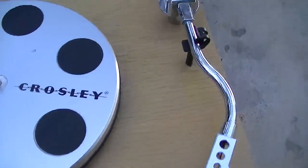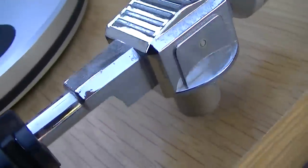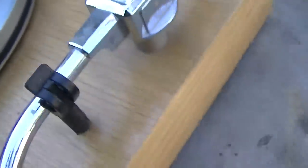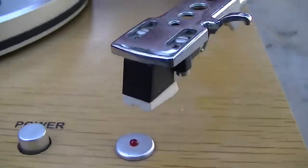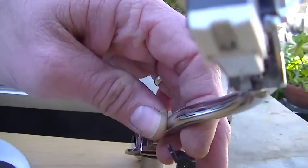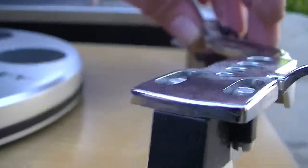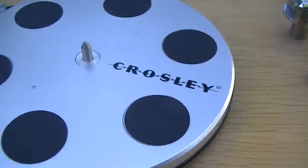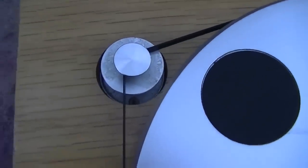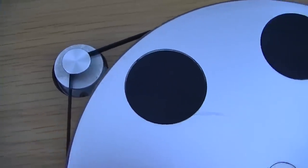Bearing is aircraft aluminum. Okay, we've got a general purpose cartridge here with a precision diamond 0.7 mil stereo needle at the end. It still seems to have plenty of life left in it. Connected to a very generic cartridge. And the precision belt drive with the belt externally located for easy replacement. Precision speed DC motor